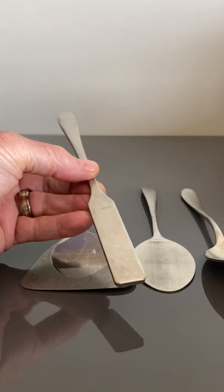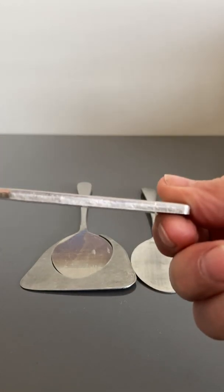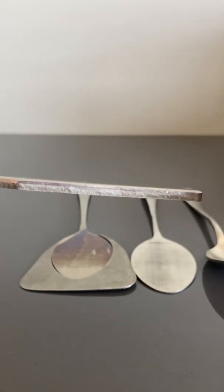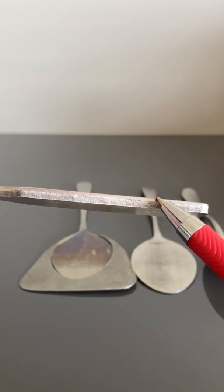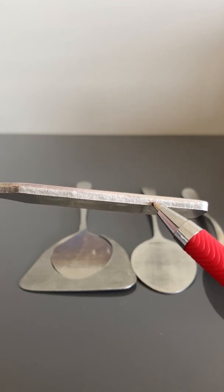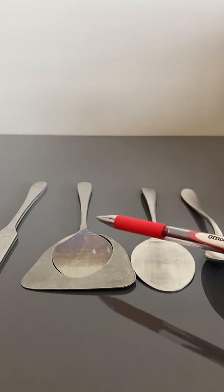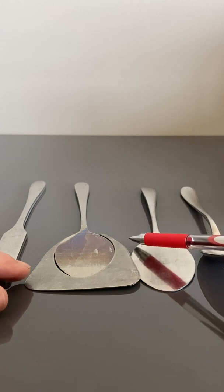The first thing they do is shear off this shape from flat stainless steel metal. If you look close up you can see that the first part of the cut is quite shiny — that's where the punch has forced its way in. The top surface has got a little radius on it but the bottom surface is quite sharp. When the punch exceeds the shear strength of the metal, this part here is reasonably rough compared to the top part — that's where the shear has occurred. The next thing is that they flatten the end, and you can see it's gone from that shape to that shape, and a tremendous amount of cold working has occurred.